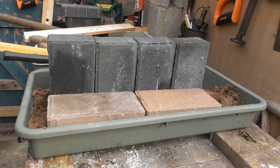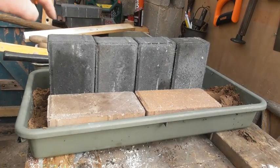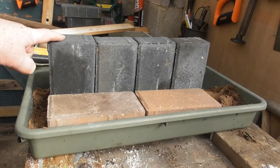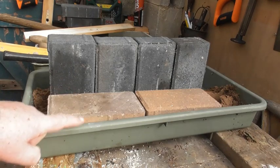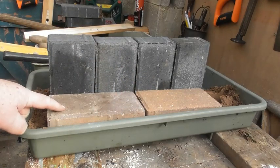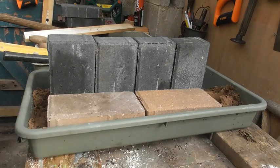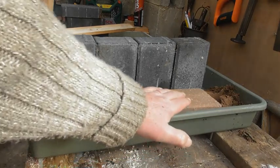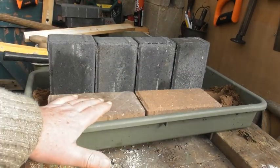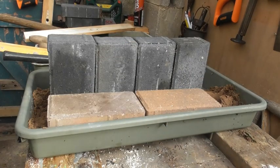The other thing to consider, whichever sticky-up edging you're doing, whether you're doing it like this, or the dogtooth or pinking shear edging as I call it, is that you can always add in against your lawn, if you wanted to, a flat layer of contrasting pavers set on the sand and cement mix and level with the lawn, and you can use that as your mowing strip, so it saves you having to trim every time up against the block pavers when you're mowing. It gives you a little bit of a gap to put the wheel of your mower on, and makes the job a bit tidier.